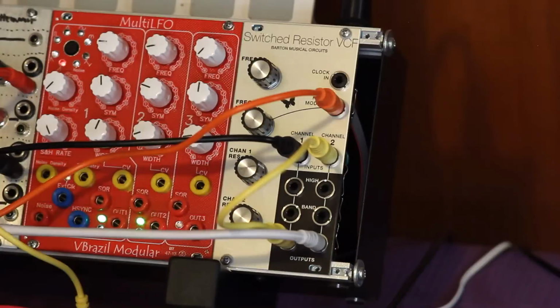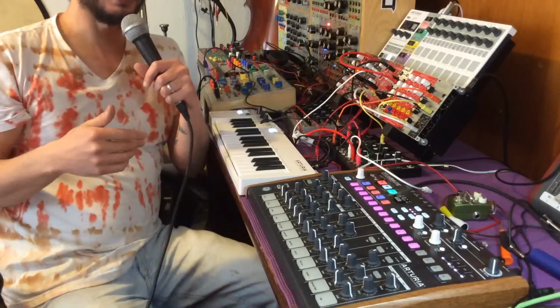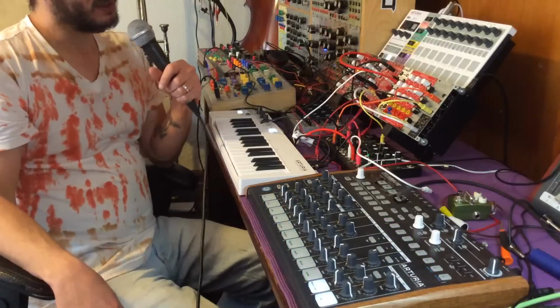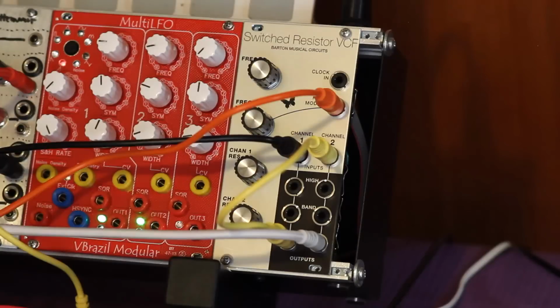Now let's look at the special feature that this filter has, which is the clock input. This disables the internal oscillator that's serving as its operational clock, which basically goes into a pulse width modulation circuit that switches a parallel resistor on and off, and that generates a variable perceived resistance in the filter's circuit, which creates our frequency sweeps. So you can replace that internal very high frequency oscillator with any oscillator of your choice. Just don't use a pulse wave. It won't work well with a pulse wave. Use a saw wave or a triangle wave or a sine wave or something like that in the clock input